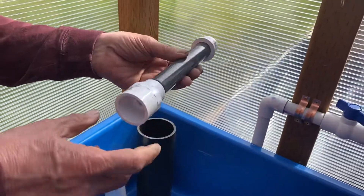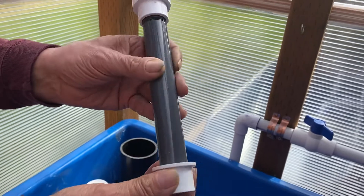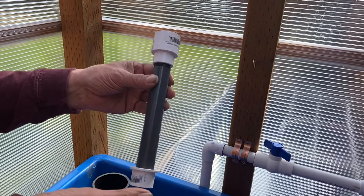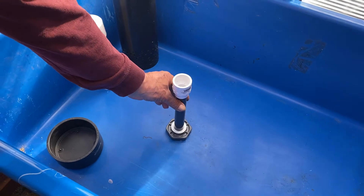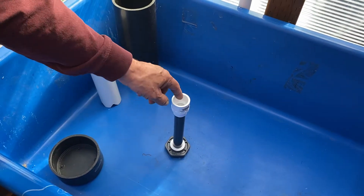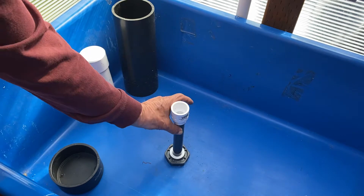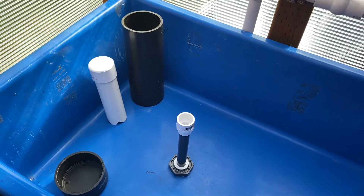Going into that, we have a slip joint, 1-inch to a 3/4 pipe. This is important — I know it's kind of technical because we're at 1-inch here, and then we're going to neck it down to 3/4. That will make the siphon work a lot better. And then we're going to neck it up with this fitting to an even bigger fitting. So when the water pours over the top, we've got a lot of water there and it shrinks down. That helps the siphon to work.